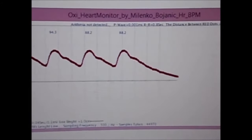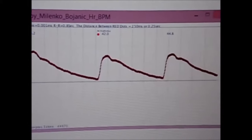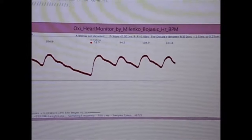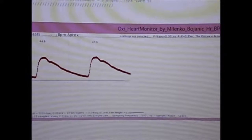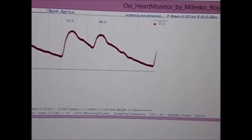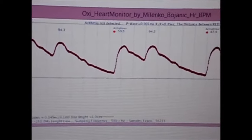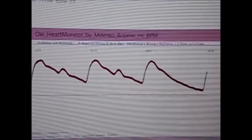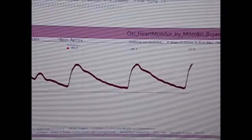Then we have power 5 volts that will power the LED connected here, and we have power of 5 volts connected to the infrared detector through the resistors, obviously. And this one is going through a resistor, which is 150 ohms, that middle one. And I use a pot, which is 1K, so that gives me really a lot of control over the LED.